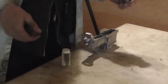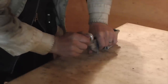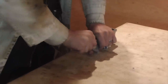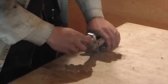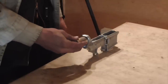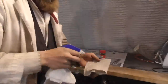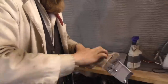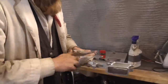Now, the one part of this component that I don't want to coat is some internal threading. So I'm going to stuff a wooden plug into the threaded hole. The wooden plug serves a dual function because it will also give me something to hold onto so I can manipulate the part without touching the powder as I'm applying the coating. Next, I put some WD-40 on a shop rag and wipe down the part until there is a thin film of WD-40 on all the surfaces that I want to powder coat.